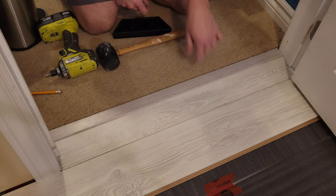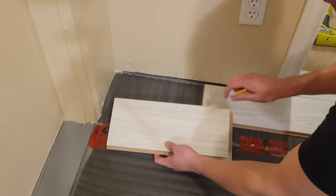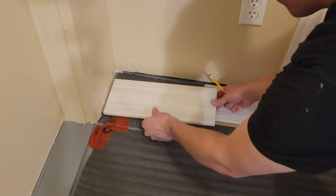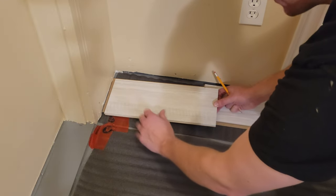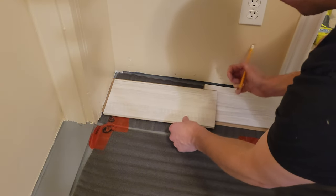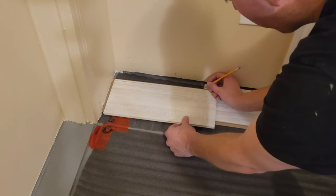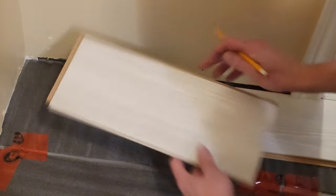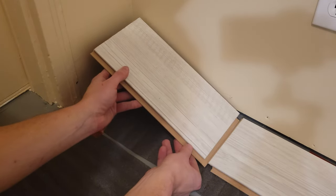I've made room for the tapcons in our three spots and I'm going to hammer the transition cap into place — there we go, transition from laminate to carpet. To fill in the gap at the wall I have this off-cut piece from the first starter strip we ripped on the table saw. I place it up against the wall with about a quarter inch of spacing for expansion and contraction — that gap will be hidden underneath the trim so we'll never see it. I mark right off the edge of the board and use the miter saw to cut it straight, then slide it in and smack it into place.